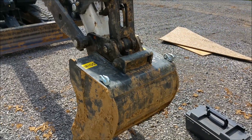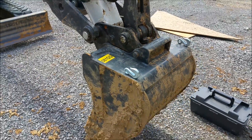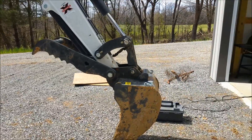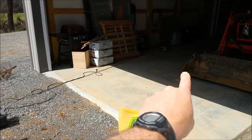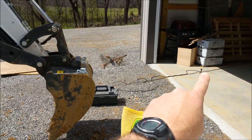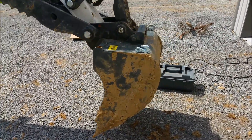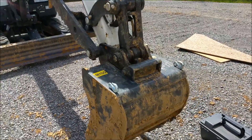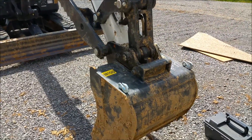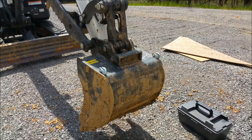I've determined this is the best location for a pair of hooks on my two-foot bucket. I've curled it and configured the arm in several different directions, and my best conclusion is that I need them like this for pulling. If I need to either pull myself out if I'm stuck, or pull logs horizontal, I can do that, but I can still curl it and lift things straight up. I want two instead of one — if I'm lifting a log with a chain, you can angle it out much easier with two hooks.